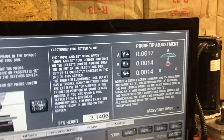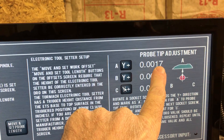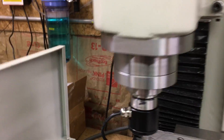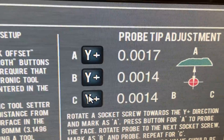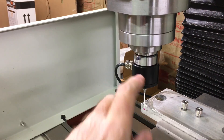I could probably play with that. Every time you adjust one of these screws, you're trying to adjust this. Say if this is the largest value right here, you would then go to A and tighten the A screw right there. But as soon as you do that, you affect the other ones. So you got to rerun — you got to check A, B, and C. You may have two or three of them moved depending upon how much you turn the screw. What I found out is when you're at this amount right here, you've got to be turning those screws just a real tiny amount.